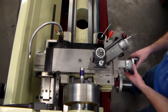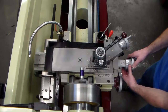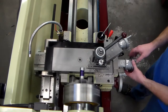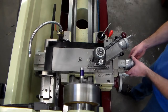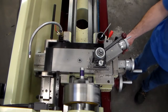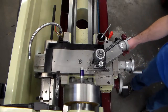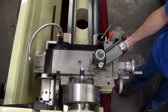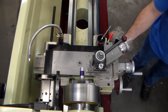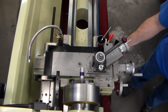I'm going to touch off here, then zero the dial and dial in a hundred thousandths. In the last video I held up a piece of paper with the cut sequence. I'm at an inch, so I'll dial in a hundred — that'll put me at about .900. Then I'll dial in another hundred, putting me at .800, and the finish diameter is .750, so I'll probably dial 25 or 30, take that pass, maybe do a little bit of polishing with emery cloth, take a measurement, and then take what's left.